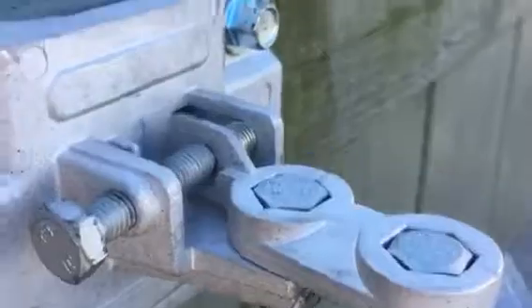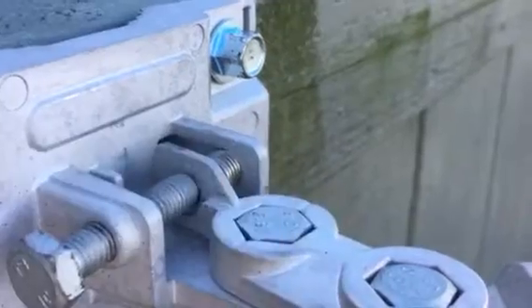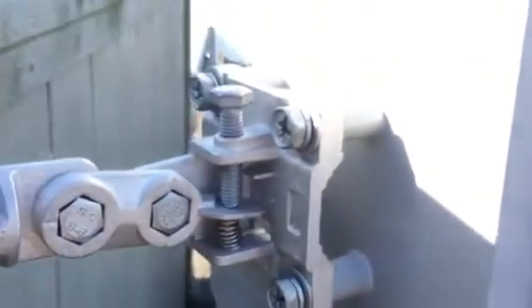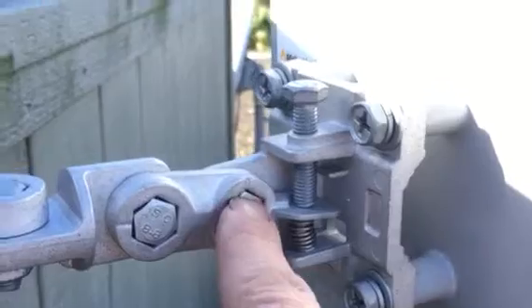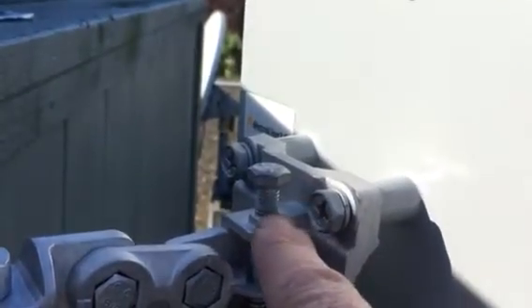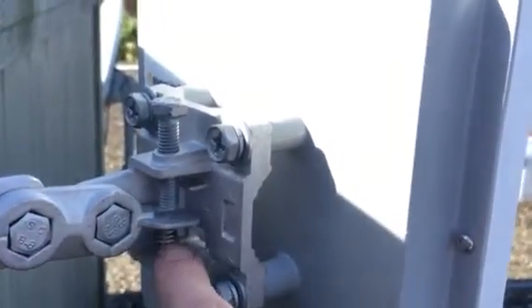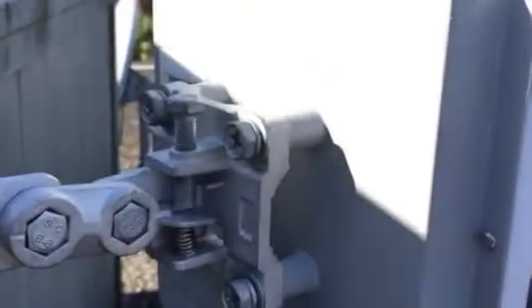When the antenna can pivot around this point, you can tighten or loosen this screw to cause the bolt to press against this little tab. There's a spring on the other side for it to return. Same thing for the vertical alignment — this is your gross adjustment, there's your fine-tune one. You loosen this one a little bit, and then when you turn this bolt, if you tighten it, you'll push on this paddle and cause the antenna to lift. If you loosen it, the spring will push and the bolt will return to the tab.